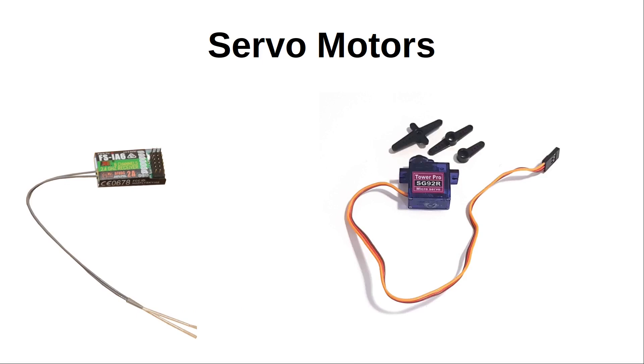You don't really need to know much else unless you're wanting to create a different receiver, as it's the receiver that will need to interface to the Pico. The receiver has six channels, each of which is able to control a servo motor. Servos are motors that can be controlled precisely using PWM. On a remote control plane these could control servos which move the rudders and elevators, or other channels can be used to control continuous rotation motors through a speed controller, or could even move a mechanical throttle on a petrol engine.